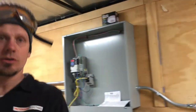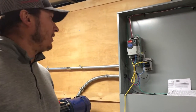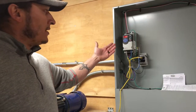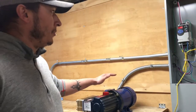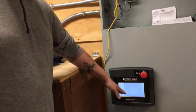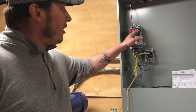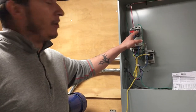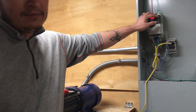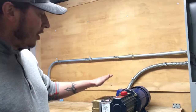I'm Gerald Munez with Pump Masters, a water transfer company located in northern Colorado. What we have here is a HydraCell pump — it's single phase going in, three phase out. This little pump is amazingly capable of pumping up to 300 gallons per minute. We're running this one on manual mode right now because unfortunately our digital screen, as you can tell from the manufacturer, is not quite operational. However, we do have a backup — simple as turning it on — and you actually operate this thing by controlling the Hertz going into the motor. This is a sealless pump, so it's okay to run while it's dry.